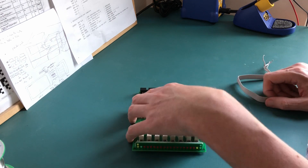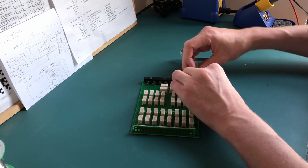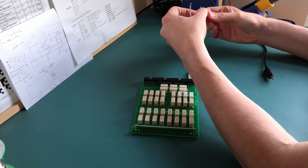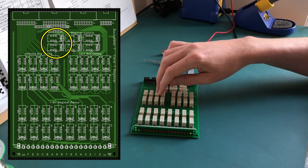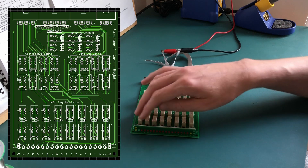So what I need to do is pop the card there, plug that in. Then with my bench power supply coming down from the shelf, I'm going to bring the positive 12 volts onto the left-hand one, and then the ground onto the next one, just making sure they're not going to short each other. With that in place I should be able to turn the power supply on — and you get a noise. That should be okay and what I expect to happen. What that's doing is putting the hold relay on, because by its default mode, whatever value's in this latch register, it should just hold them in place.